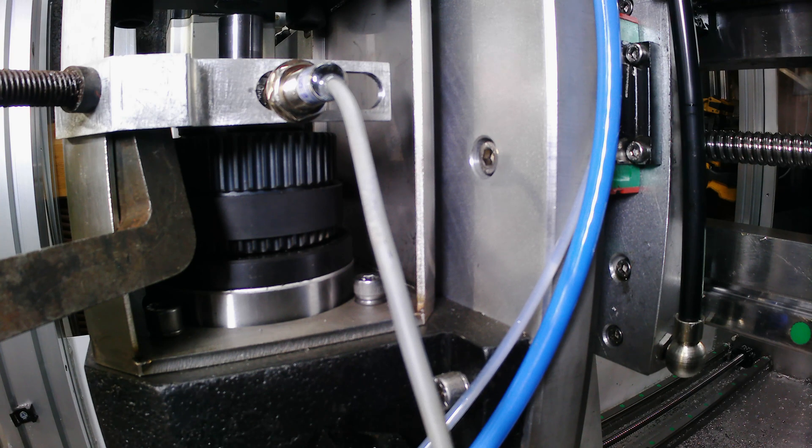I've made my bracket to mount the sensor. I don't know exactly where it will go yet — I need to make an actuator. Conveniently, there's a series of tapped holes in the top of the timing belt pulley, so I think I'll use one of these holes and make a little aluminium block shaped to fit. It will then actuate the sensor.